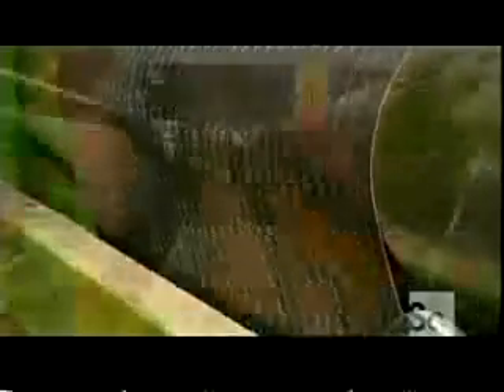The cloth is unwound into a machine with a printing press. Rollers lined with rubber printers stamp product information onto the cloth. The cloth then travels underneath the printing press, where more rollers apply a heat-setting adhesive to the unprinted side.